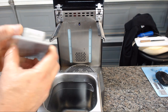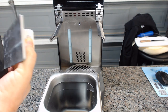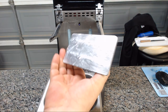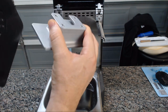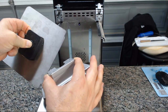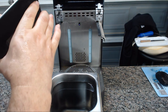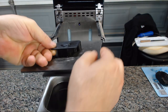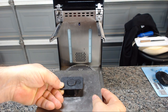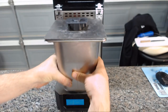Pretend this has a print hanging from the bottom of it, and it's fresh out of your SL1. Again, you would normally be gloved up at this point because you're dealing with wet resin covering these parts. You're going to push the knob on the back here, like so, which pops this out. You're going to slide it on, and now it's locked to it. You're going to put that onto the tank. Going to lift this onto the unit.